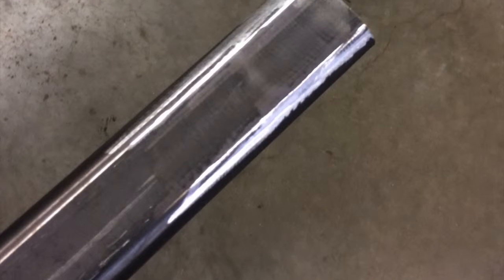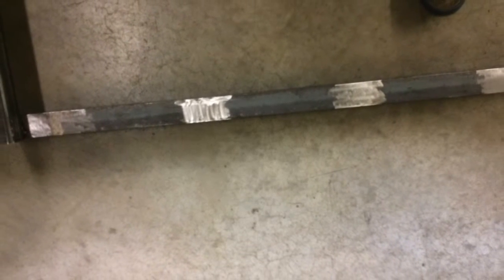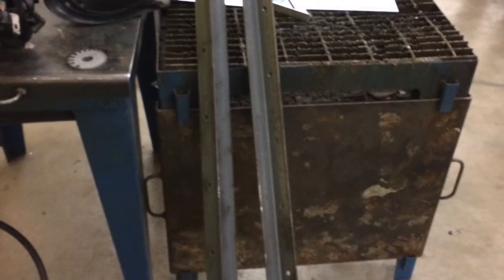So I ordered all the metal, went and got it with my dad, and so yeah, we got it. I cut out the angle iron, and then this is just a giant piece of square tubing, really thick. Welded it to that, and ground it down for the horizontal pieces. There's another picture. Then these are the custom pieces I got. We had them plasma cut at Midway because if I had to drill them, it'd take me like 3 weeks, and I didn't have that time.